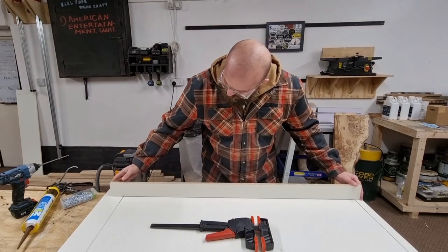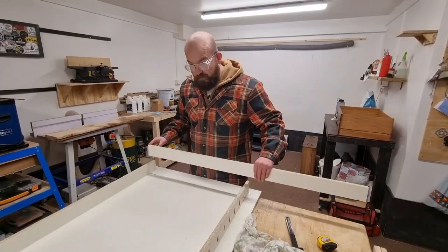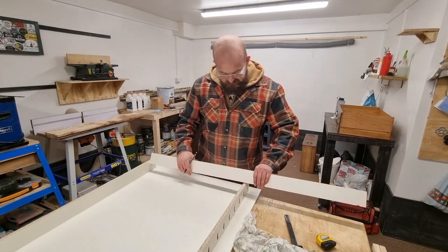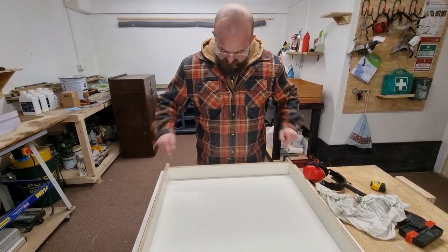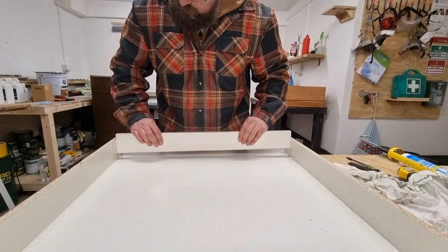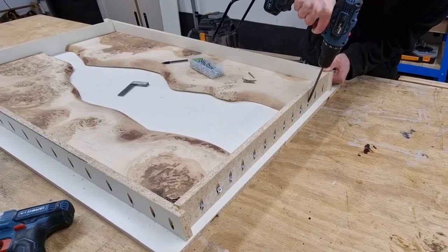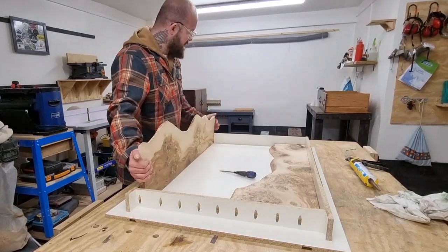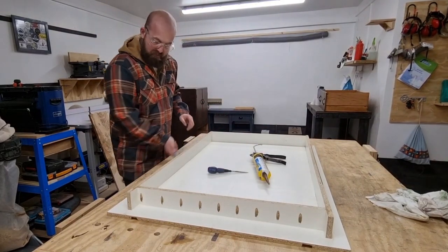Put the black line there to place it onto. For the top and bottom piece we'll just take a referential measurement. I'll take this one first, we'll put the slabs back in and then push it right up tight against it. It's a nice tight fit. Then I'll put some screws in from the side here and pocket hole it in down. I'm going to pop the oak out now — everything's nice and tight. I'm just going to give it a dust off and then put a bead of silicone all the way around the inside and the outside and not miss a single spot.